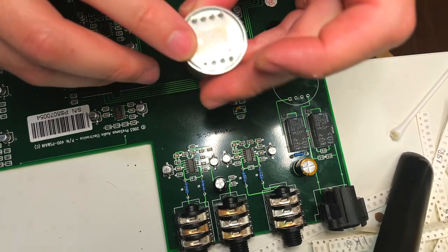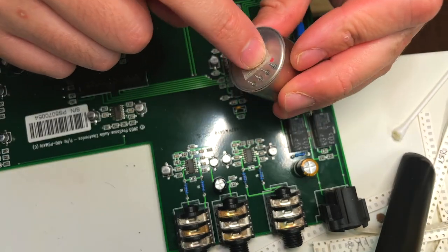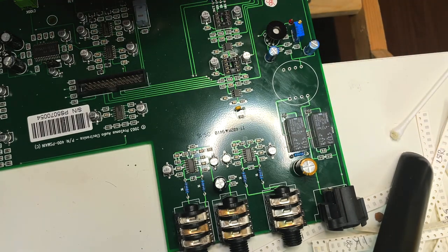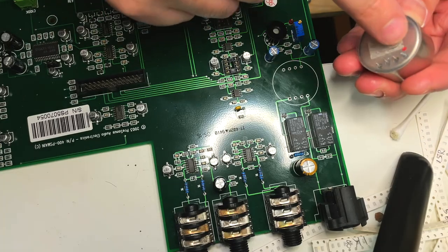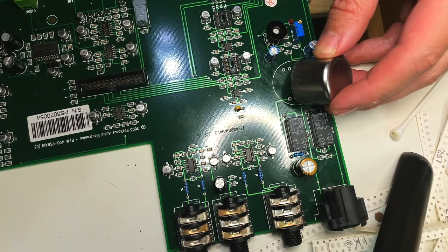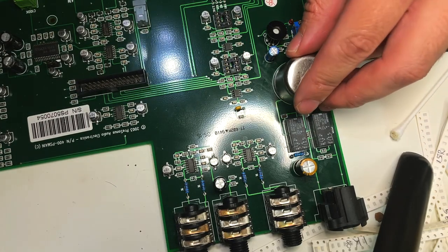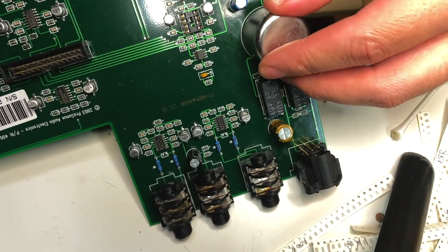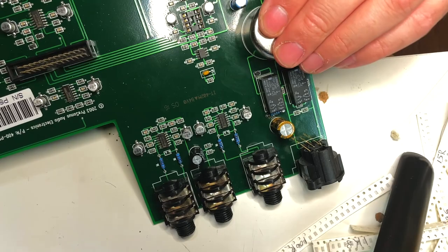The red dot on the bottom of the transformer signifies pin 1, so note the orientation when installing it. The new Cinemag transformer didn't come with a plastic spacer to decouple it from the PCB, so I used a clear plastic spacer off the old transformer, which is held on by adhesive, but you can easily remove it just by pulling it.